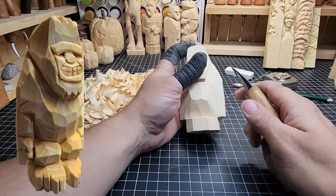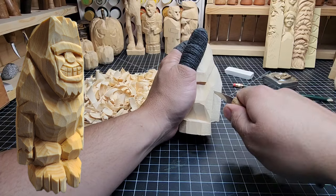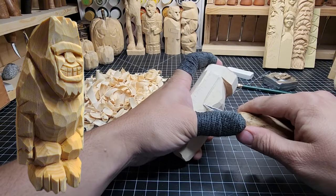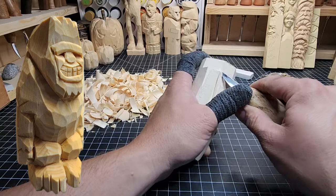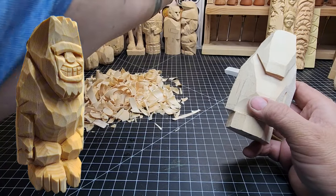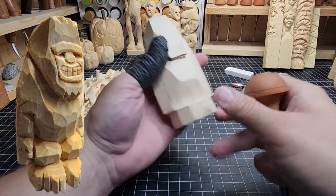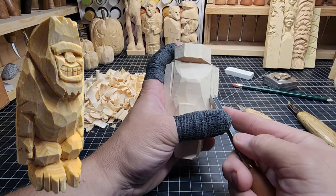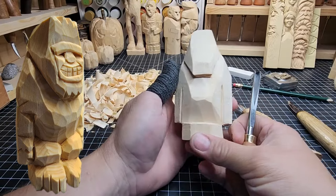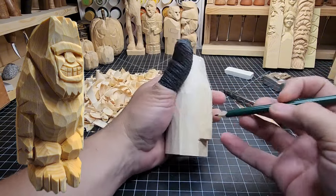Now for the arms, I'm going to use a detail knife - a Flex Cut detail knife - and go at an angle about 45 degrees off from straight in, then come straight down. Then we'll come in at another angle 45 degrees the other direction and just pull that chip out - like a nice little long V cut. That's one way of opening up that arm. You don't have to do this with just a knife - you can also use a number 15 Swiss made V tool. I like this V tool - you can do the same thing and get in there and push it right out. The V tool is quicker and allows you to pilot that cut more easily.